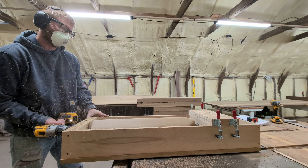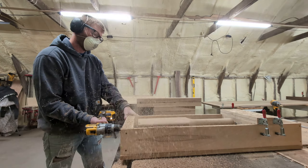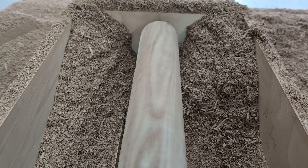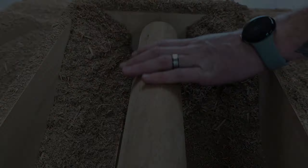To get things rolling we're going to start with the legs, and these legs are going to be cylinders. I'm using my homemade jig for my table saw. It's a little bit sketchy but it actually does a really nice job in making cylinders — just a little bit of cleanup work when you're all done because the cut is really rough. You can actually keep spinning the cylinder and rub sandpaper back and forth and that speeds up the sanding process.